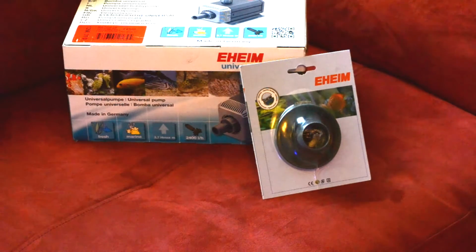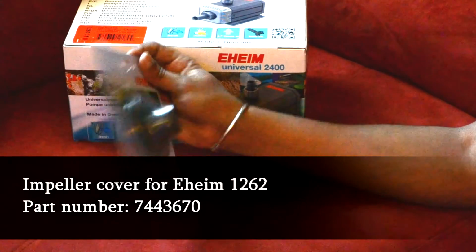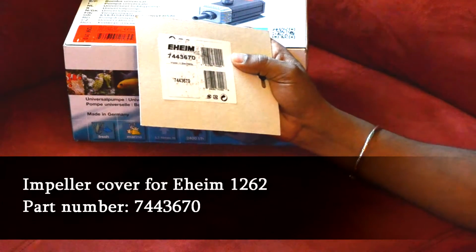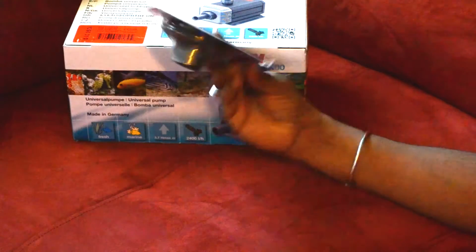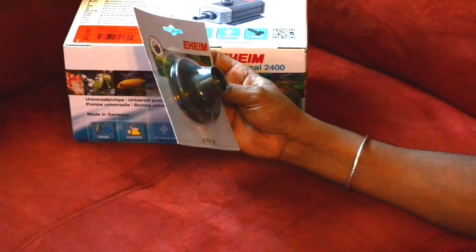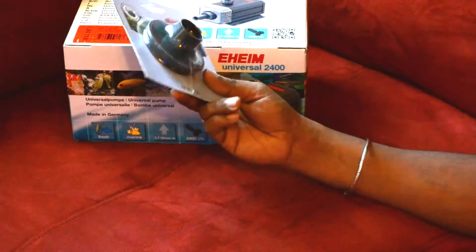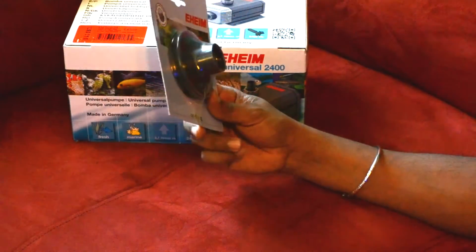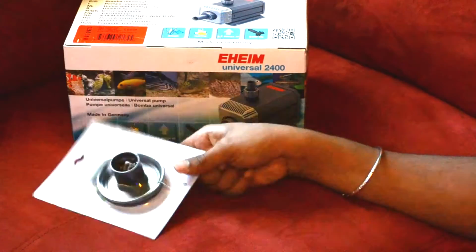Got a quick video of the 1260 to 1262 mod, the Eheim return pump. I got a brand new 1260 here and an Eheim part, part number 7443670. I'll take pictures of it and put it on the video after I'm done filming. Basically, you replace the one that comes with the pump with this one, and it opens the flow, so to speak. The one that comes with a 1260 is more restrictive than the one that comes with a 1262.